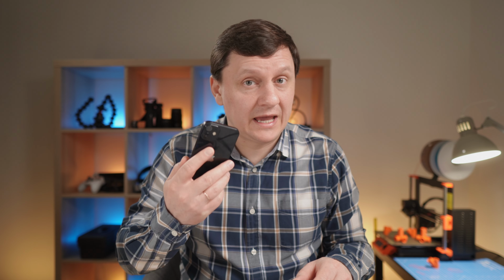I do not have a proper tool to measure noise level. Can the iPhone measure below 20 dB? I don't know. I was not able to find any technical information about the iPhone's microphones. For example, this Audio-Technica AT2020 has self-noise of 20 dB. It's very close to what the iPhone showed in the room. And Sennheiser has self-noise of 15 dB. It is even lower. When I started this project, I just wanted to know how big is the difference between a cheap microphone capsule and mass-produced microphones.